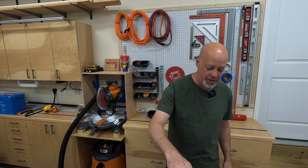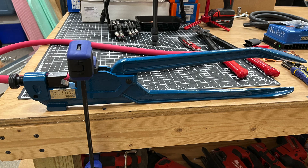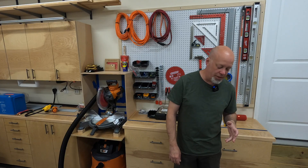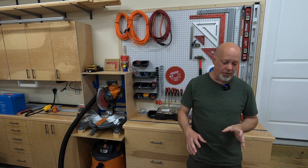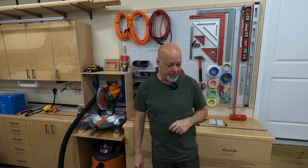One of the next things you're going to need to make this work is a really big crimper. You probably can't see that in my frame here, but I have a picture up for you, and I have that clamped to my workspace. If we zoom in here, you can see that I have the dial turned to the 4/0 sizing for crimping. So I am staged and ready to get my wire going.